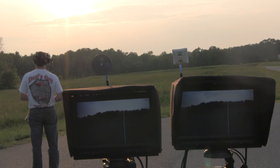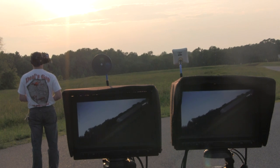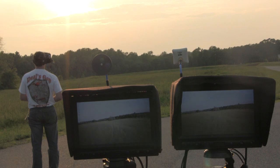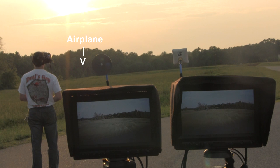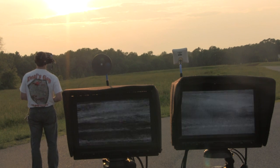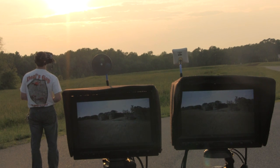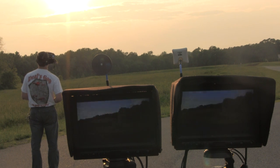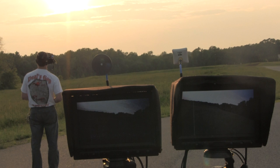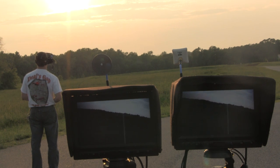Now I'm near a half mile away again, but this time very very low to the ground. Both are doing very well, especially considering 25 milliwatts, but the helical again is holding actually significantly stronger. And now I'm making my way again behind the trees, thus the trees are once again going to block the signal. As you can see, both are struggling as I make my way around the trees and through the little tree hole and around the back side. I'm making one last approach behind the antennas, then off to the right-hand side of the field. Here I am behind the antennas and the helical's holding a little bit better. However, once I get out to the side, the helical again is getting much weaker than the patch, thus confirming that it is something with the helical out to that one side. I guess the reason for this is likely because of the matching strip on the helical is on that side, and that gives it a very odd side lobe out to that side.